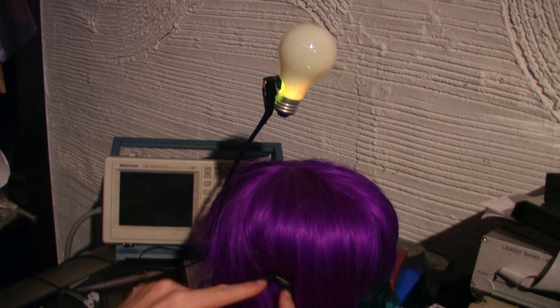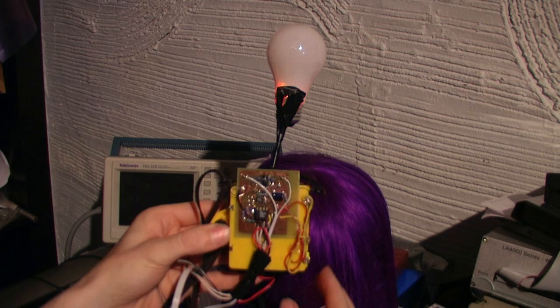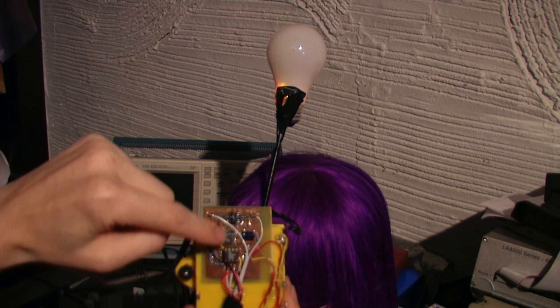It's springy enough to allow it to clamp to your head. After about six hours of wearing this, you really, really feel it. It kind of clips over your ears too, so it helps keep it on your head. And then this bundle of wires comes down — you slip it into your clothes and hide it — and it comes down to my geek pendant, which I wore around my neck, which was a couple battery packs, a circuit board with an instrumentation amplifier — this Analog Devices one — and some op-amps and some comparators.